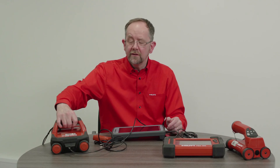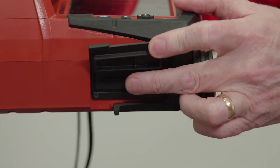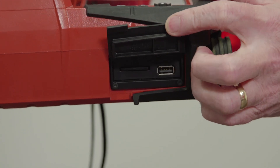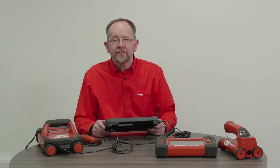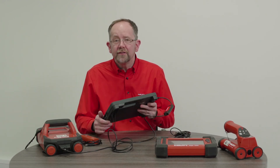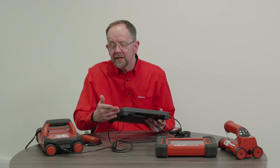As an alternative, we can use the USB connections or the SD card to transfer data from the scanning head to a PC or tablet. Should you wish to carry out further analysis of the scans transferred to the monitor, the monitor can be easily connected to your PC or laptop using standard USB technology, and then you can use our PROFIS detection software for further analysis. This software is available from our Hilti website.